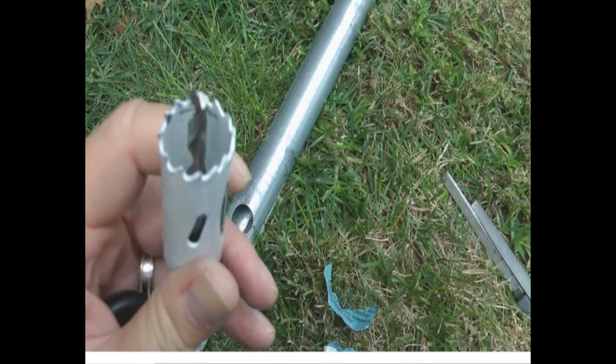I had a telescopic pole and I drilled a one-inch hole using a hole saw — it was really easy. To remove the burrs and sharp corners, I used half-round files, plus some sandpaper to smooth the hole. The next thing I had to do is run a fishing tape, like an electrician uses, up the pole to get the coax and start pulling it back down through the hole.